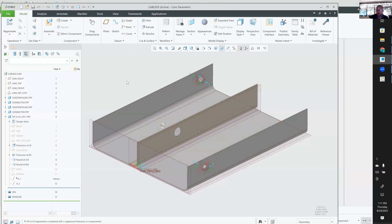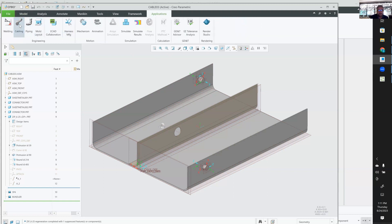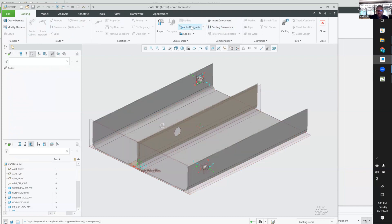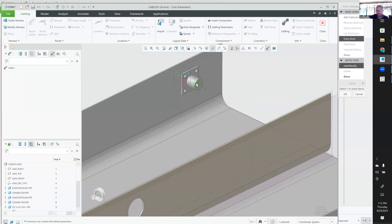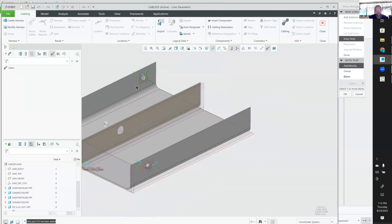The first thing you have to do if you're going to route a cable by hand is designate your cables. I'm going to jump into the cabling software. I'll just undesignate them and then designate again. I'll pick this connector — because it needs a unique name, I could type one in or just take a default name. Then I have to define the entry ports. Notice the coordinate system is focused with Z out. I'll hit the middle button — it's asking how much deeper you want the wire length to be, negative to Z — I'll just put half an inch, choose the round version, and hit the middle button. You'll notice down here it says it was added.